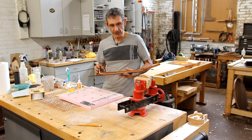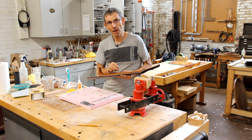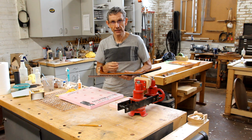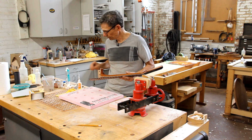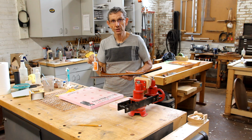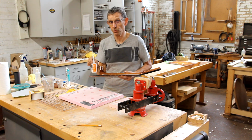Now, in the old days, I used to do that with a drop fill of lacquer. You used to have to drop fill it, let it dry a day, sand it, buff it, and then hope that it didn't shrink. GluBoost makes this a much better repair, and I'm telling you, this stuff is a real game changer.